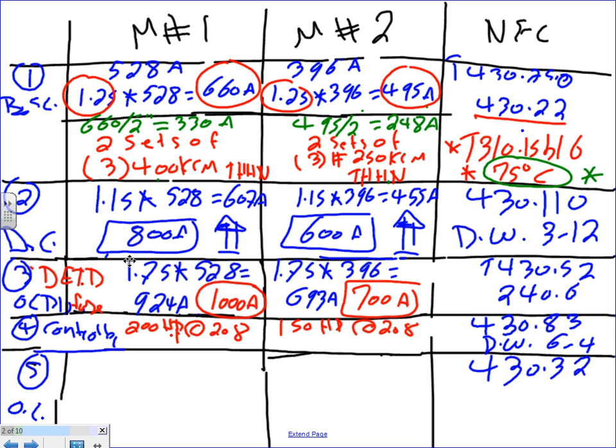The second thing, we need to go to table 6-4. Can you guys go to 6-4, please? With me. We have done that before. If you go to 6-4, this will give you a NEMA size. The voltage that I have is 208. Can you see it's 208 right under 200? Am I single phase or three phase? These are all three phase. So we're going to go to 200 horsepower.